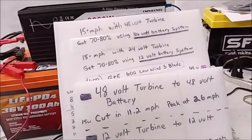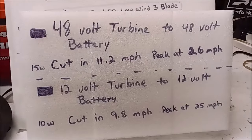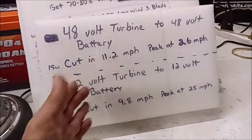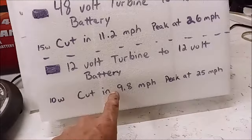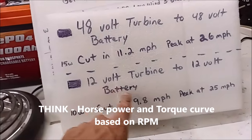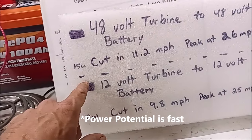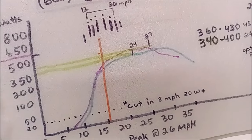The ones with five, six, eight, or twelve blades sound like cats having a party on your roof - your neighbors don't need that. A 48-volt turbine cuts in at 11.2 mph; a 12-volt turbine, because you're only trying to get it into the plates of one battery, cuts in at 9.8 miles per hour and starts charging - not much, about 10 watts at 9.8 mph. But a wind turbine is like horsepower in a car: another quarter mile per hour is 18 watts, another mile per hour is 25 watts, another four miles per hour is over 150 watts - it's highly progressive.